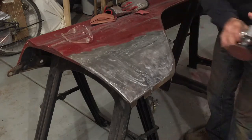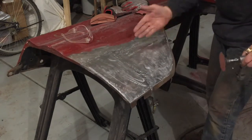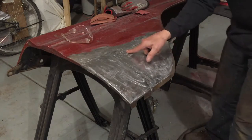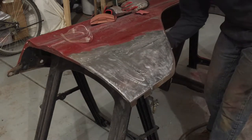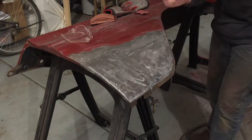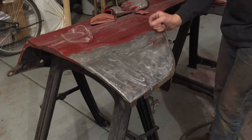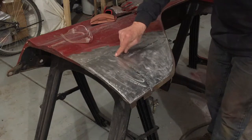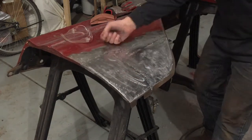So I welded this panel up with a butt joint. This area ended up being just slightly higher than this area — you can see the dark edge. You want to clean that up as much as possible. I could bend it, tap it, and flatten it out. But I could also just leave it and not risk going through that weld — if I keep cutting I might end up through that weld surface and that panel is going to split. I do have very good penetration — I can fill all the way through on the other side. I left about a sixteenth of an inch gap, pretty much the thickness of the grinding cut wheel. That will allow enough of the metal and the weld to really get a good butt-to-butt joint.